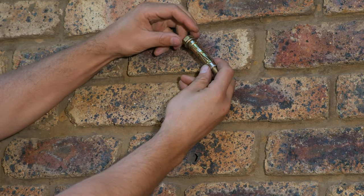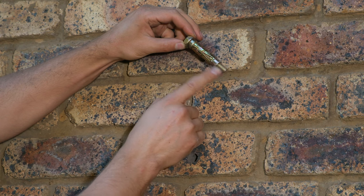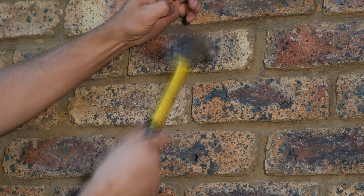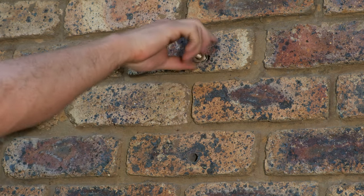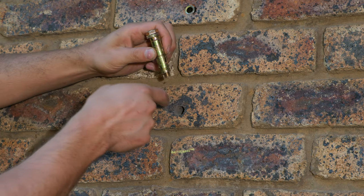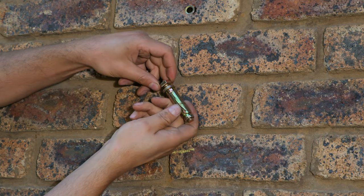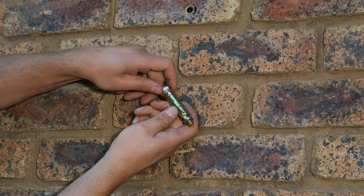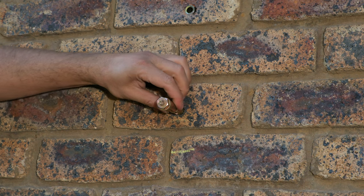Now I need to get the expansion bolt in the hole. It's best if I turn this almost to the end so that when I'm hammering it in, this nut part doesn't come out of the expansion sleeve. I take my hammer and I gently tap it in, making sure it goes all the way in. I can now remove the bolt part — that is what it should look like. If you find that it's too snug you can just go with the drill and widen the hole a bit, checking it time after time. Following the same procedure, I turn this just till it's close to those washers — it doesn't have to be tight, in fact it shouldn't be tight. There's a little bit of free play but that's fine. Now I put it here and tap it in.